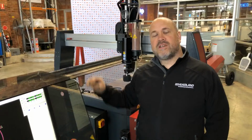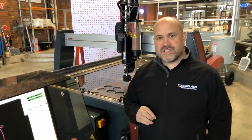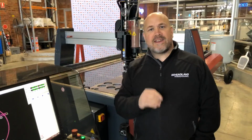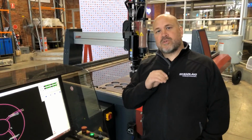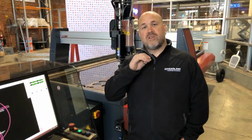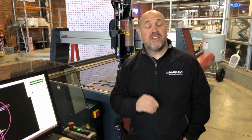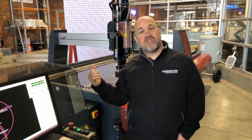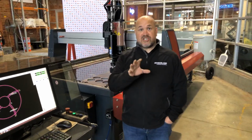Omax have developed the IntelliTrax drive system. It's a traction drive, like I said before. What that means is there's no mechanical interface. With no mechanical interface, you get very, very little wear. You get no backlash on your system at all, which means you get continuous, accurate cutting that doesn't wear over time. All right, so what we're going to do is take a quick walk around to the back of the machine where I've taken one of these covers off. You can actually see the drive system. So follow me.